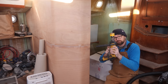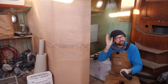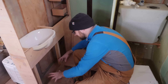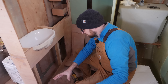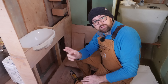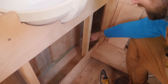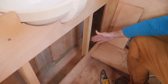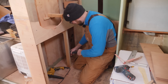Now let's get to some hole drilling. I've got this 50 millimeter or two inch conduit here and I need three of these between the head and the nav station. The further out towards the hull I can place those holes the better, because this space here is going to be very cramped. There's going to be a heater here, I need a hole to drain the sink into the shower sump, and I also need the hot and cold water to come from here, go underneath the cabin sole and over to the galley. The challenge is that the hull is pretty much flat here, so if I drill a hole way out there's not going to be enough room between the cabin sole and the hull for the conduit. A couple of smaller exploratory holes should help me answer that question.